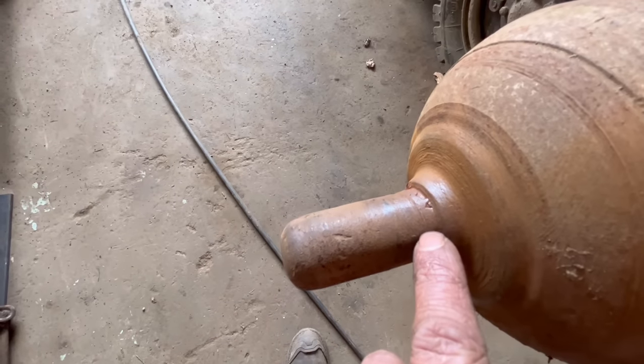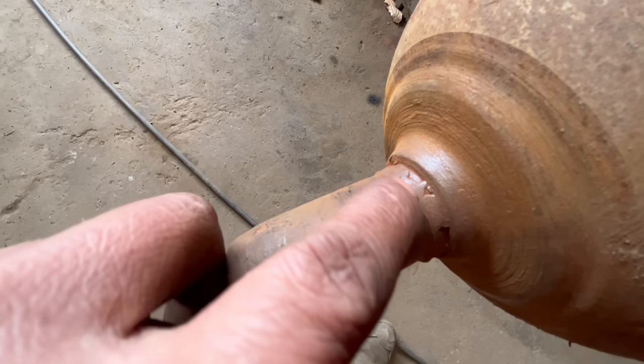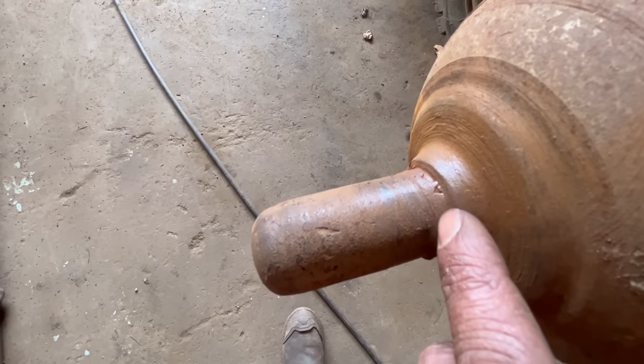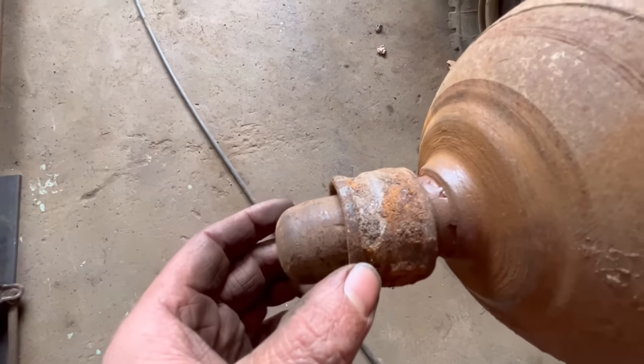Yeah, I think this is meant to have had a step on it originally. You can see where someone's been round it with weld and then ground it back down so the bearing fits on it, which will have done away with the step. And then the bearing has just been sliding on the shaft and wearing the shaft out.